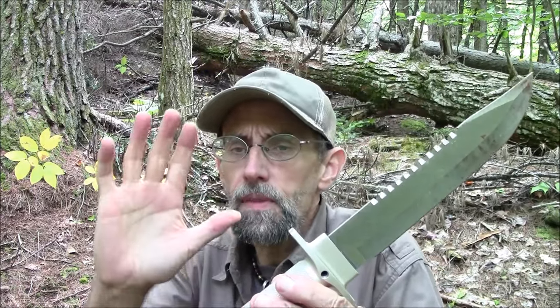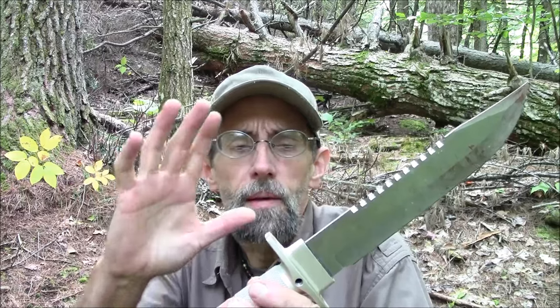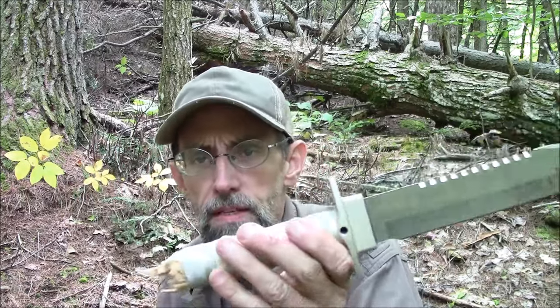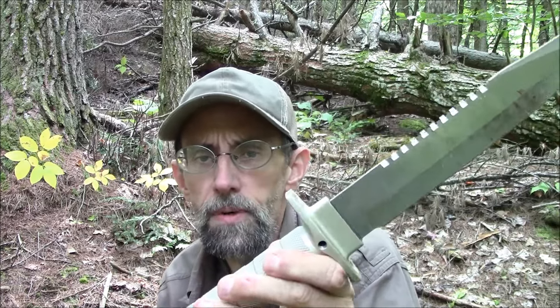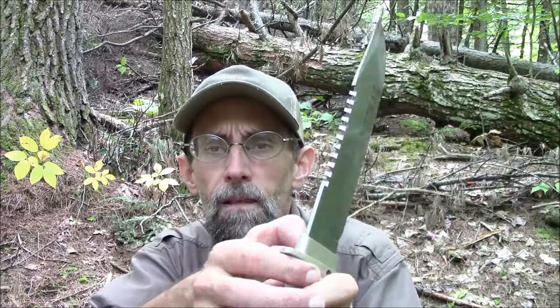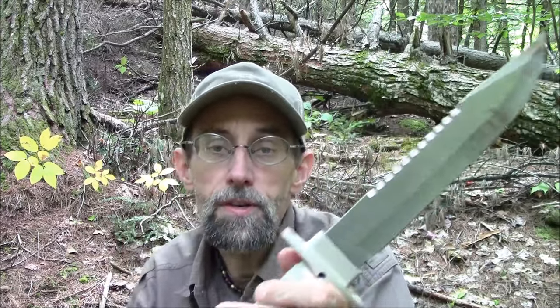Okay, so I just got to let you know that I put the JB Weld on there. I let it sit for 2 days. I forgot to mention that. I let it sit for 2 days, and this morning I was checking it out and it seemed like it wasn't completely cured. You might have seen in that second batch of JB Weld I made, I was rushed, and when I watched the video I'm like, oh no, I didn't mix it thoroughly enough, so maybe that's my fault, but I let it sit for longer. I should have.